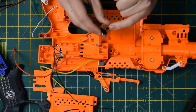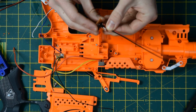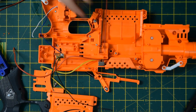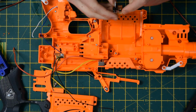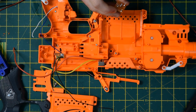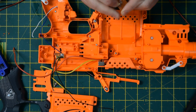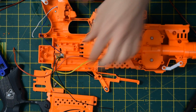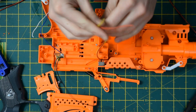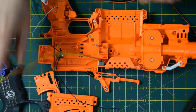As you can see here, you've got this header pin set up. We provide you with a JST plug which allows you to plug in whatever control switch you're using. We then have these large solder pads in 3 locations for your ground wire, your V battery wire, and the motor negative battery here. I've already soldered up this motor block with stock motors because the Aussies are taking their sweet time getting their motors to us.